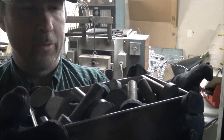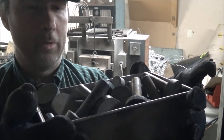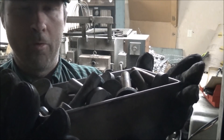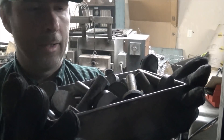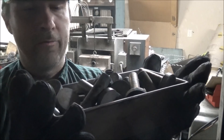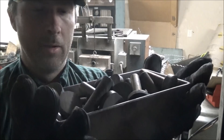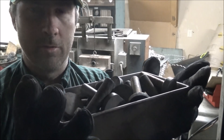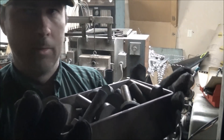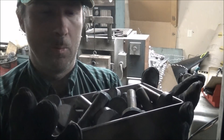There's this nice little order of tappets going back in for their second round of tempering. We've got them cooled off down to air temp, and now it's time to throw them back in and get them heated back up — this will be their last time. Next time when they come out, they'll be ready to go to the lathe for hard turning and over to the surface grinder to get their faces finished up, and these will be ready to go to the customers. So that's going to complete this video for the heat treat. Let me get these put in the oven and get these cooking.